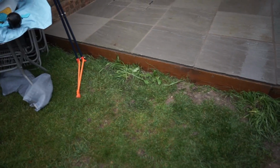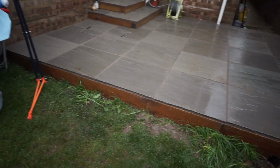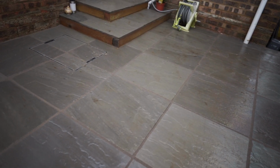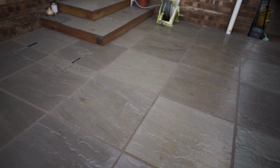The substance on the slabs, but hopefully once it dries up it can just be swept off. But I've also pointed along the front in there, and then also in the steps as well, so it's just got a nice finish to it and prevents it from seeping behind the timbers and just gives it a bit of longevity. So we'll see how we get on, but it is able to be applied in the wet or in the dry. Obviously probably better in the dry.